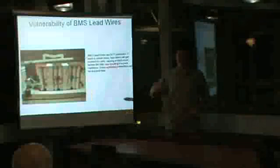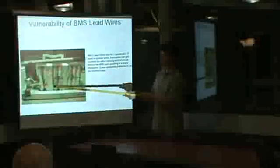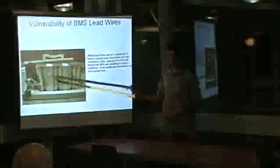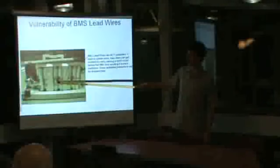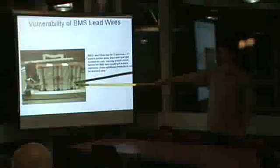But no one's going to guarantee that you're always going to put the battery that way. Some people might mount it on their bike upside down. Then you have the weight of all these cells pressing on these plastic wires. So there are several layers of protection. I mean, you have the heat shrink over the cell, there's the insulation on the wires, and this is plastic rather than metal. But at the end of the day, if you have dozens or hundreds of these out and people riding on bumpy roads, you just don't know what could potentially wear through and cause an electrical short inside the battery because of the wires to the battery management circuit.